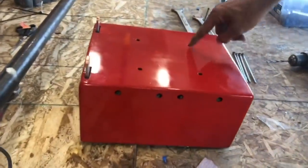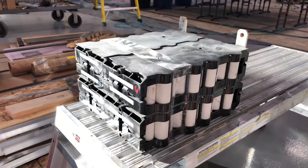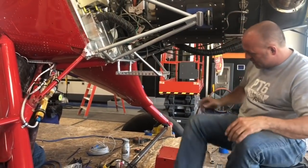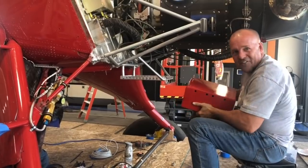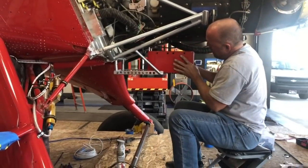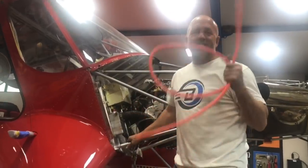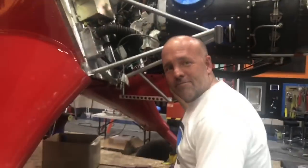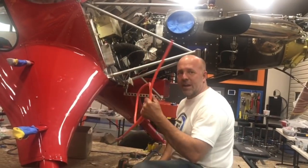I'm sticking in my battery — this is the lithium-ion battery I made. To anchor it, inside I've got four stainless steel sleeves that carry all the way through the battery. It holds the lid down, keeps the battery in place, and goes all the way through the tray. I just finished drilling the holes; the bolts go through the tray and through the top of the battery — it won't move. Half the weight, twice the power. My battery is now bolted down, main terminals tied in, and I've got about six more large cables to run, including two back to the jump-start plug-in unit at the rear.